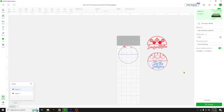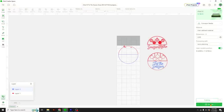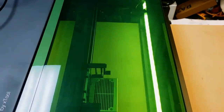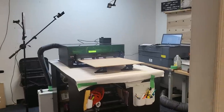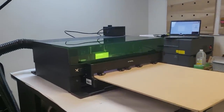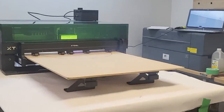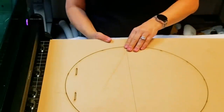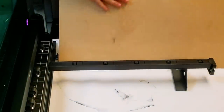Let's go ahead and frame this out. Framing looks good — let's run it. However, with the automatic conveyor system installed and the riser base open front and back, the air purifier wasn't really doing much. It had a hard time sucking the smoke out since the machine was no longer enclosed. It was so smoky that the smoke alarm actually went off, so we ended up moving out to the workshop. Our test cut was unsuccessful — the smoke in the chamber reduced the laser power.